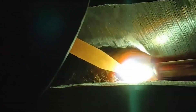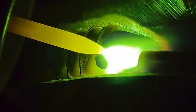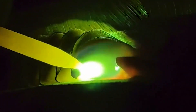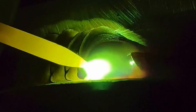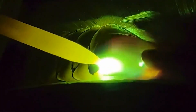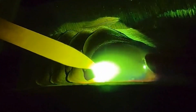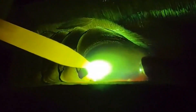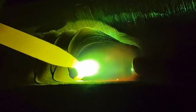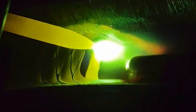The reflow finishing method is used when welding reaches the end point: the angle of the electrode is appropriately changed without extinguishing the arc, moved in the opposite direction, and then the arc is broken. This method is suitable for alkaline electrodes and helps control molten metal to avoid dripping and aid weld formation.